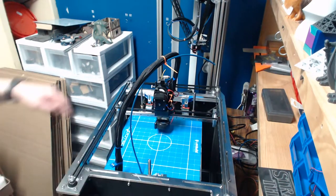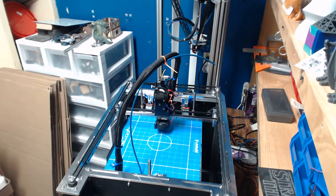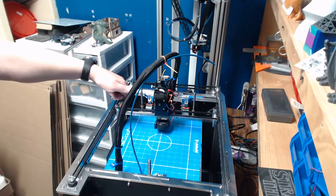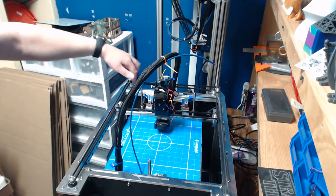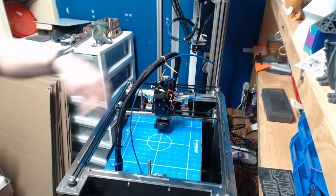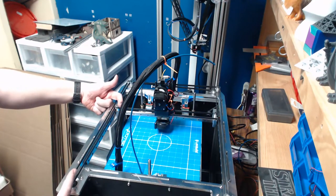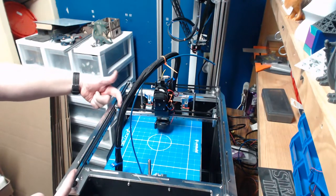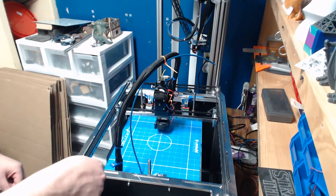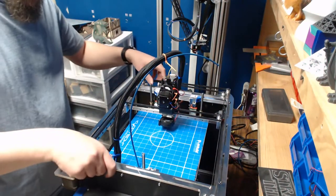I just used the belt thickness off of the back to half the teeth on the pulley. And then same here, belt teeth on against this pulley to belt teeth on this pulley. So these two are in alignment, exactly. And then this one was the tricky one to get the stepper spacing right. It required some funky math because I had to discount the belt teeth and measure off of the teeth of the pulley. It was kind of weird. But it lines up, so that's awesome.